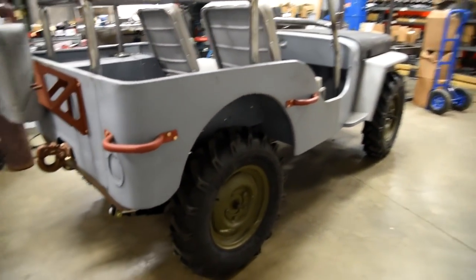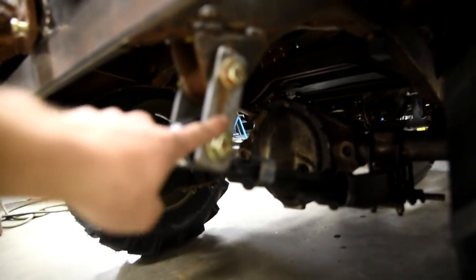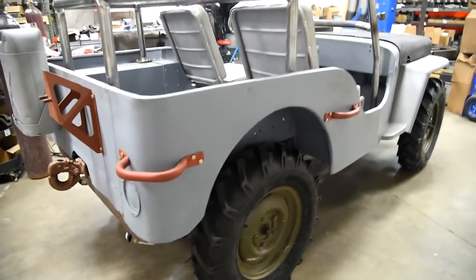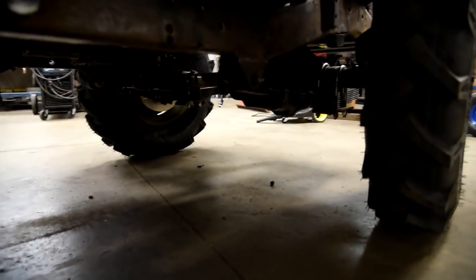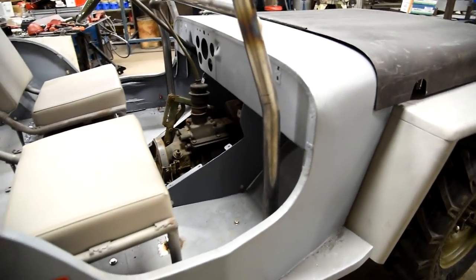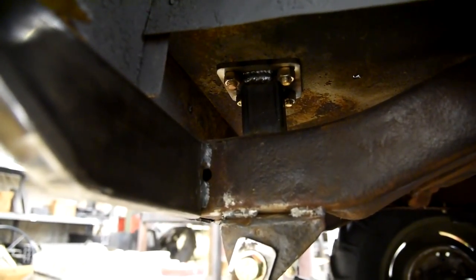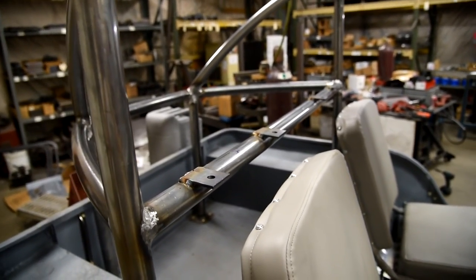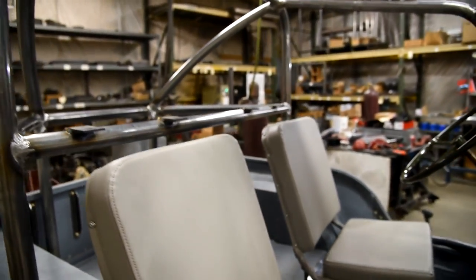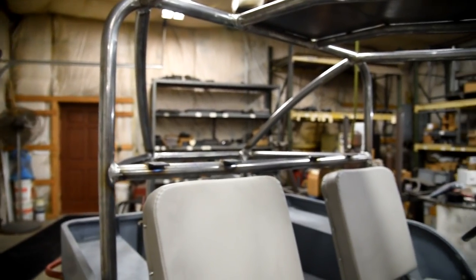Now with the bigger tires and the suspension — this is OEM suspension basically, all just standard leaf springs, 8 front, 9 rear with custom shackle made just like my other Jeep. I don't know who thought the C-shape shackle was a good idea back in the day, but we can't have that. I have about 10 inches of clearance on the diffs and then about 13 inches on the transmission crossmember. The frame is bolted to the roll cage up here as well as back here. I also have tabs for the racing harness shoulder straps — I need to cut these up a little bit and make them pretty, but they are at the correct height, which is why the bar sits up a little higher than I planned in my rendering.